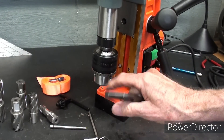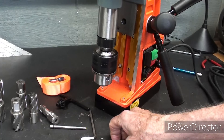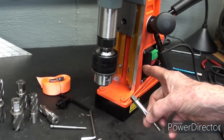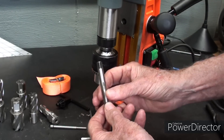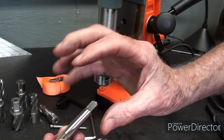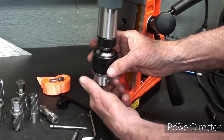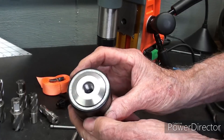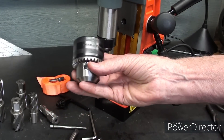I installed the chuck because I'll be able to drill holes with twist drills up to about half inch or a little bit over, whatever the capacity of that chuck is. I had hoped in a future video to do some tapping with it, because there is a reverse on this model — they make several models of this. What concerns me about tapping is two things: the hardened jaws of the chuck may not grip a hard tool very well, and since the chuck is threaded onto the adapter, when I put the machine in reverse, more than likely the entire chuck is going to spin off when backing a tap out under power. That remains to be seen in a future video.